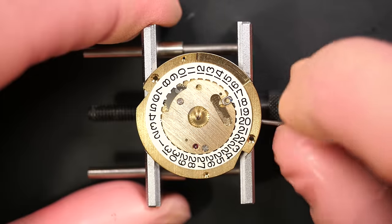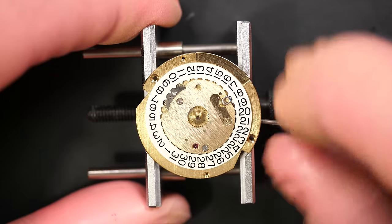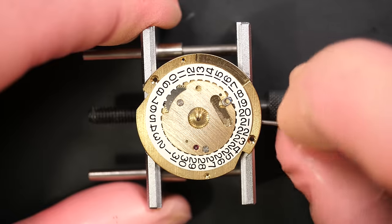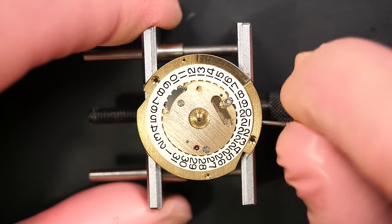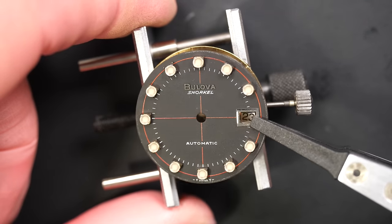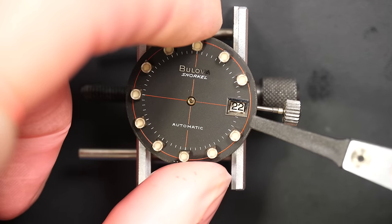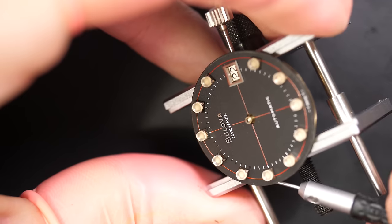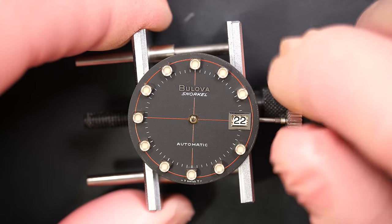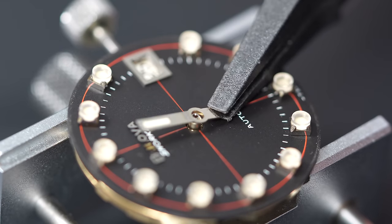Let's see if the disc is jumping — yes, perfect! You can see the wheel turning. Interestingly, this mechanism has the wheel turning anti-clockwise, whereas on most mechanisms the wheel and date disc turn clockwise. The jump is now much nicer than when we received the watch — before the jump was very weak when changing the date, now you have a nice snap. Putting back this beautiful dial, securing it with the dial-fit screw. Let's change the date and check the jump — yes, a nicer jump!